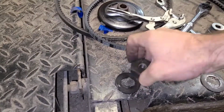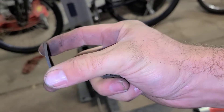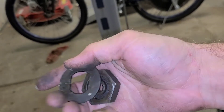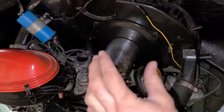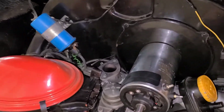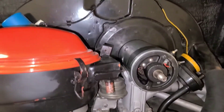I can tell it went on and it's not grinding as I turn it anymore. Take your curved washer with the curve facing out — it will push on to the back — and then put our nut on with the flat side out. Before you tighten that nut down fully, make sure you're turning the washer until it clicks into place and locks in, then hand-tighten it for now just to hold things in place.